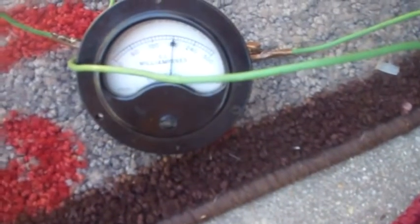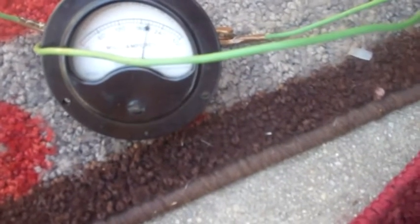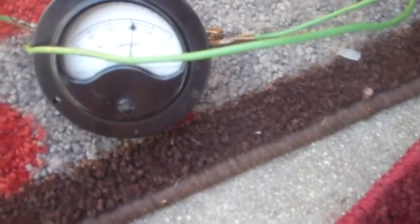Now I've got another problem where the CRT is being extremely overdriven to the point where it extinguishes the filament, and the brightness control does little to nothing. This bias issue seems to be in the CRT socket, because, well, here we go. Here's the problem right here. The green is just broken off, and the focus wire is just broken off.